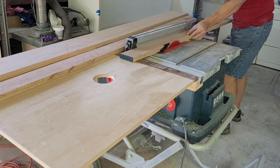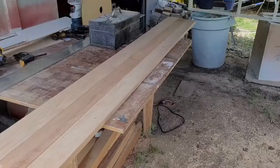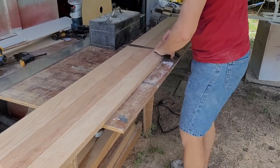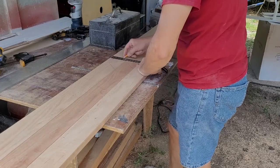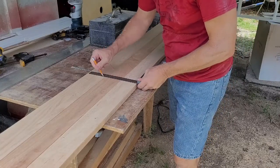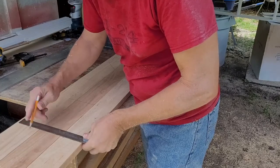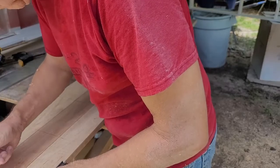Both boards were ripped down to strips at the table saw. For this piece I needed three of the strips. Since I don't have a jointer yet, I flip one piece over to equalize any twist or warp in a board — it's not a great solution but it works. The third board is again set in place to minimize any warp or twist. Now we can locate the positions for the biscuit joinery. I like to start at least three inches in from the edge and set them about eight inches apart, which provides a lot of alignment and some extra strength along the joint.